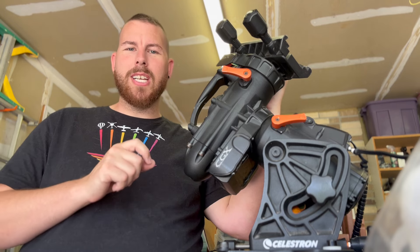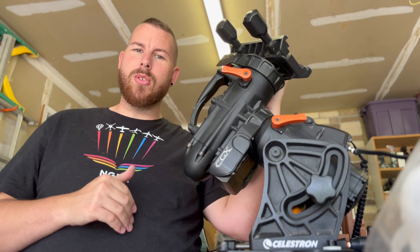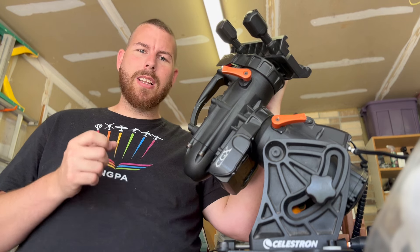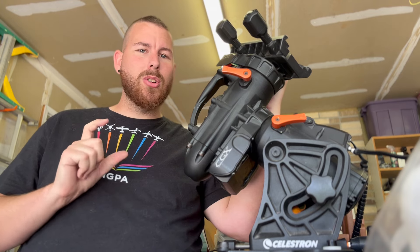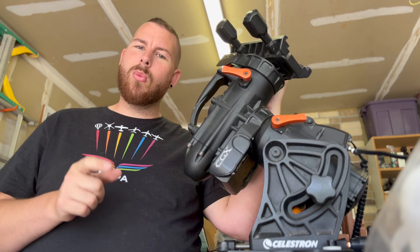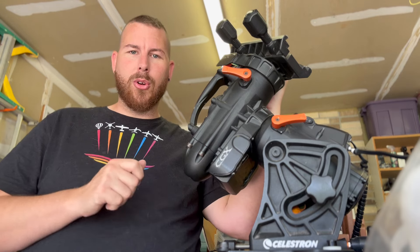Normally it's just an adjustment of the tension between the worm gear and the main spur gear here at the top, so hopefully that will fix the noise issue. The other thing I wanted to mention is a lot of people don't really pay attention to how tight the belt is. The belt matters a lot because the harder you torque that belt, the more tension it has on the whole system. But you also don't want it too loose because the belt can fall off, so we're going to take a look at what the optimal tension would be for your belt.